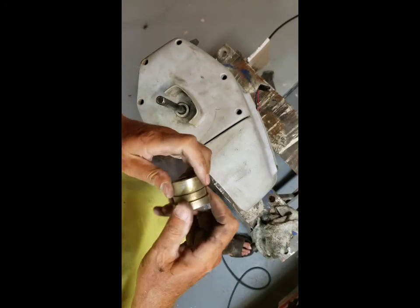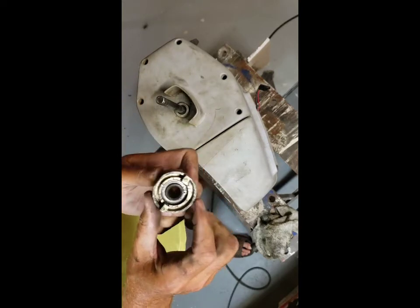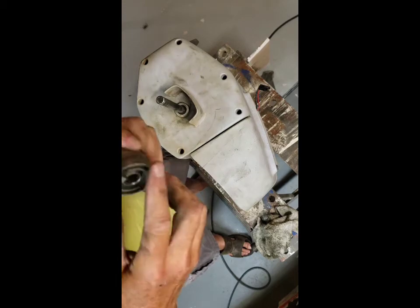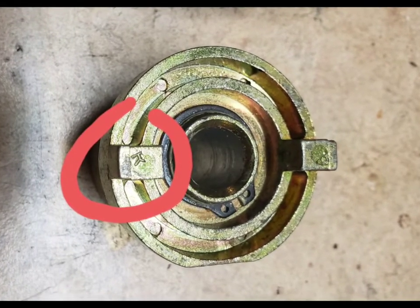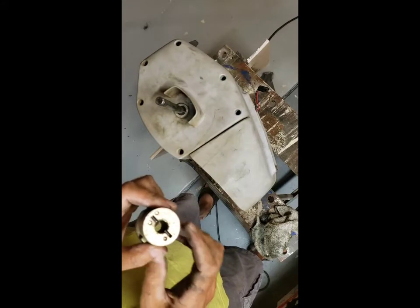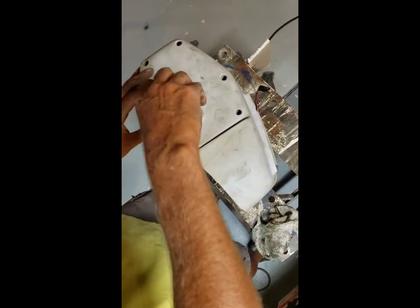That's the clutch. There's a clutch on each side of the axle — the clutch is what keeps the cart from rolling backwards. You should be able to turn one side of it by hand and only in one direction. There's a left clutch and a right clutch. As you're standing behind the machine, you'll see this one's stamped with an R — that's the right clutch, and it's on the gearbox side. The left clutch is on the mounting bearing side.